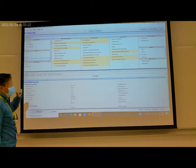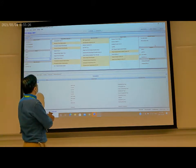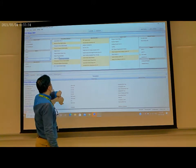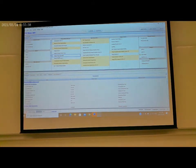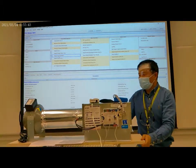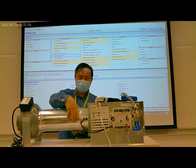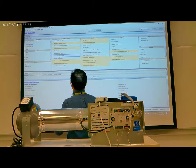This is an input set point. And also we need to check the supply airflow calculation. This one is for the system to calculate the airflow. This is the duct discharge, the airflow through discharge. How much is the airflow? Then we click it.